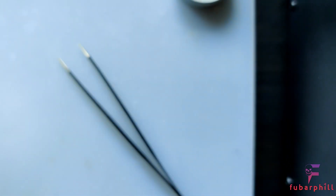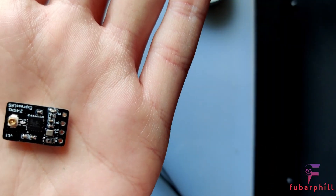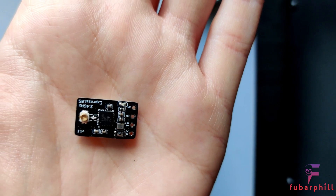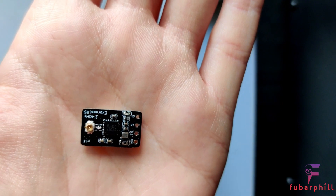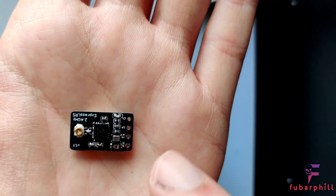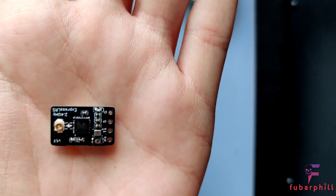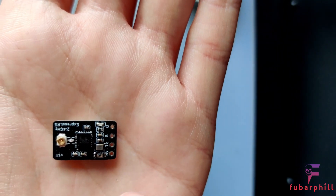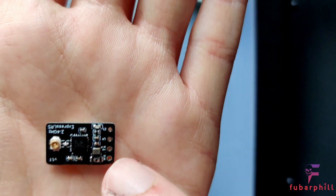That's the second side finished. All I need to do now is solder up to an FTDI USB-to-serial adapter, making sure that TX goes to RX, RX to TX, and providing 5V input power. I'll use the ExpressLRS configurator to flash — I won't go through that on screen as it's basically the same as the method used with the transmitter, so take a look at my transmitter build. The one thing you do need to make sure is that the settings for your transmitter match the settings for your receiver — if you're using hybrid switches on one, use hybrid switches on the other; if you're using 500Hz on one, use 500Hz on the other. And obviously make sure that your bind phrase matches on both transmitter and receiver. Once it's flashed I'll come back and let you know how it went. If I have any issues with the button again I'll be sure to let you know.